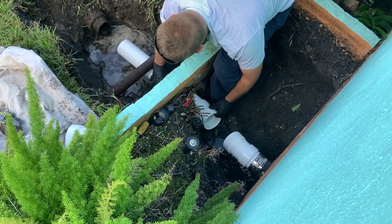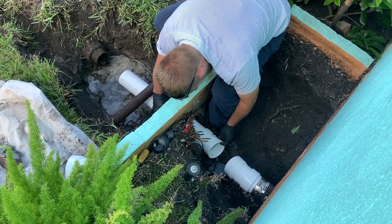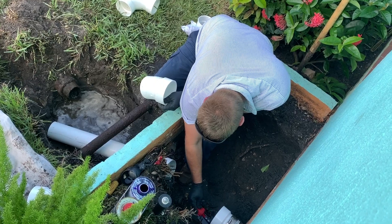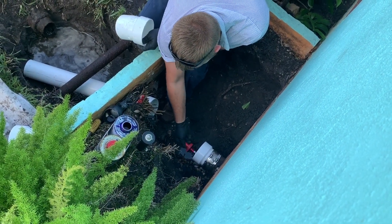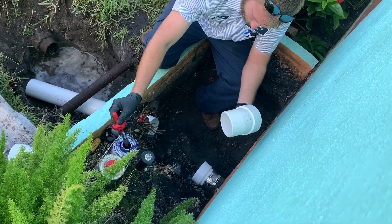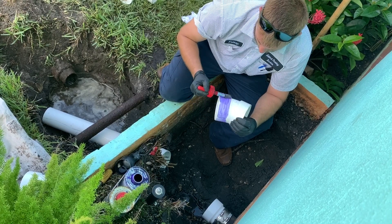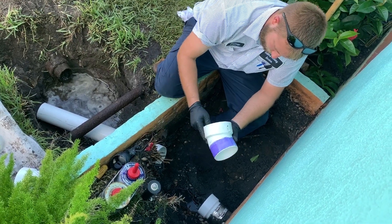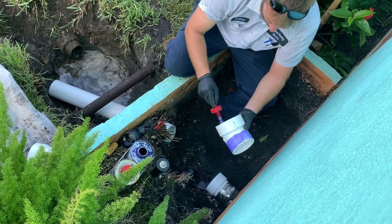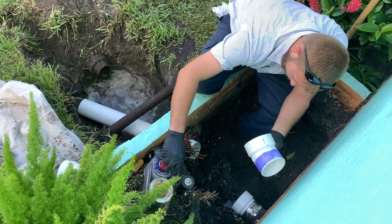Now you've got to figure your angle — the first glue-up is getting close. If you smell this stuff, it's probably not good for you — it'll make you see funny things. He's putting it on both surfaces. That's the primer. Then you put the glue on over top of the primer. The primer doesn't need to set or dry before you apply the glue.